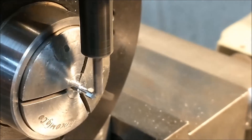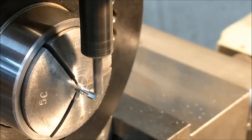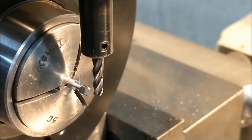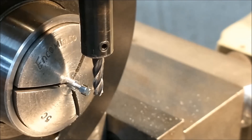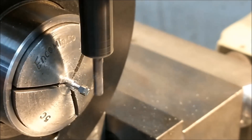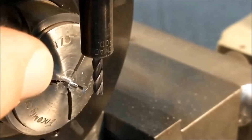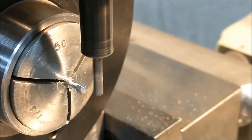Once you like what you see, come up with your final height. It's starting to look like a Z shape, formed by two primary relief cuts and the initial cut that formed the two-flute geometry. You can make a four-flute if you want — just be careful how thin it gets. You can see the cutting edges being formed with some remnant black still on there from the 0.125 initial blank diameter. As long as that black goes away, you're going to have clearance. For getting those gummy chips out on the aluminum I'll be cutting, I'm going to take this down farther than it strictly needs to be — then I'll take it to the sander to remove the faceted edges.